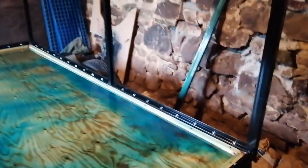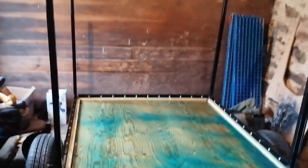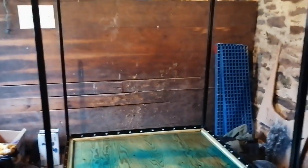What we did find is on the horizontals that we had put in, when we first put this one on, it was fouling as it came down. So again, got the hacksaw out and chopped about 2 mil just to make sure it cleared, and I've done that on both the front and the rear also. Again, those tabs are going to be hidden, so aesthetically it doesn't really matter what they look like.